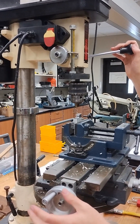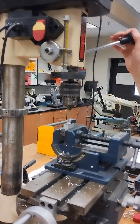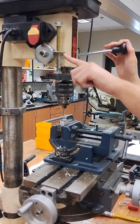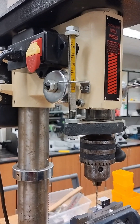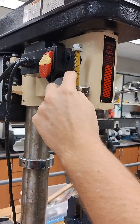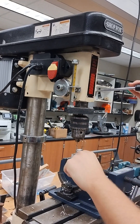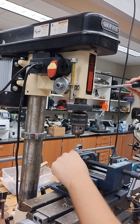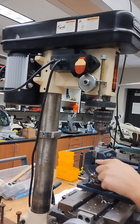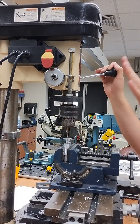You shouldn't see the drill bit shift at all as you touch into that spot. On here I have a gauge — this is at a half inch when I'm touching my part. So if I want to cut a one-inch-deep hole, I'm going to go to one and a half inches. Make a mental note as to how deep you want to go. I don't want to go all the way through this part — it's an inch and a half between the top and bottom, so I'm not going to go all the way through.